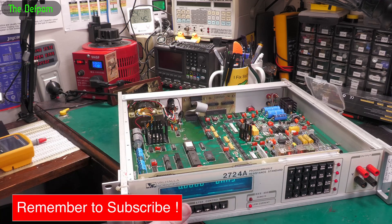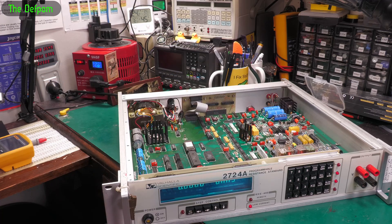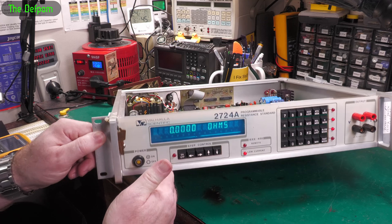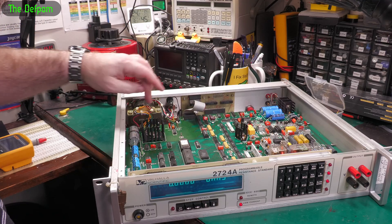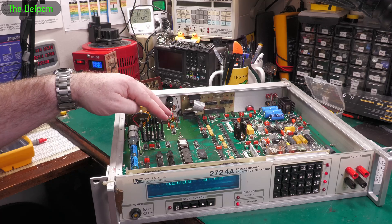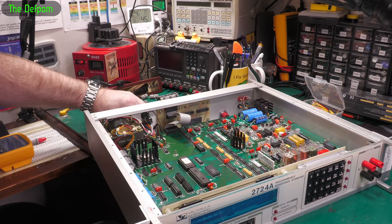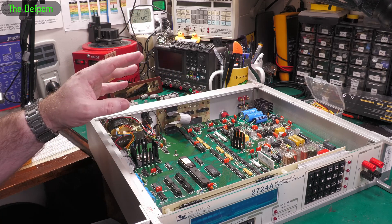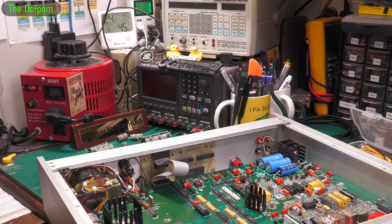Current draw is actually lower - it was 41 watts before, now it's 25. That's interesting; mind you, 41 watts might have been with that shorted tantalum I had before - I don't remember actually. Maybe that's okay. Anyway, it's doing 138 milliamps. No smoke. Check for anything getting warm, which is a sign of putting one in backwards. Yep, all good - nothing problematic there. Excellent. I'm going to pull this EPROM out next and make a copy of that. But first we'll check these capacitors to see if any of them are actually bad, because I don't think I've tested them out of circuit. They seem to be basically okay - there's only a couple I wasn't quite sure about, they seemed a bit odd.